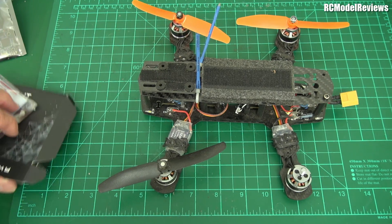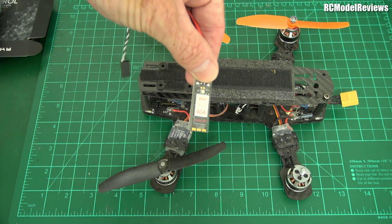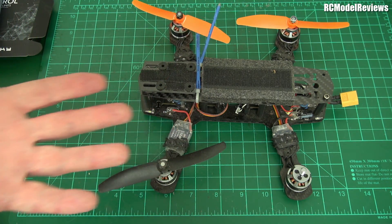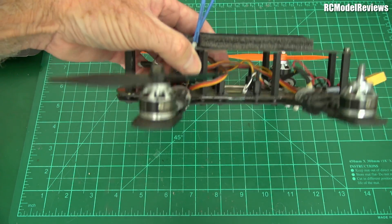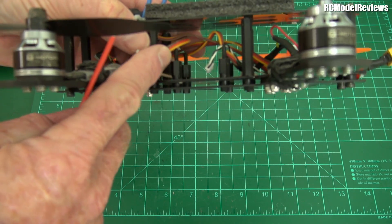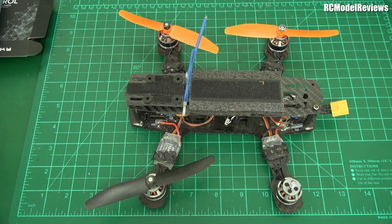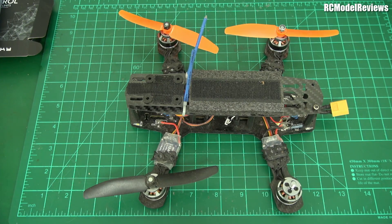DYS also sent me a care package which includes some of their cool 40-amp 32-bit ESCs. The big thing these days is a stack — a four-in-one ESC, flight controller, and video transmitter all stacked together. These weren't very stack-oriented, but the flight controller was supposed to be mounted up high, so we'll go with traditional separate ESCs. 40 amps — that's a lot.